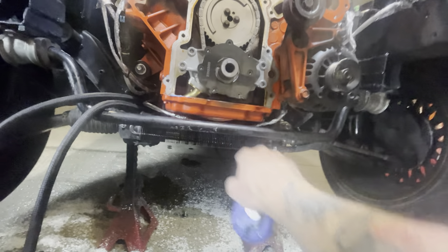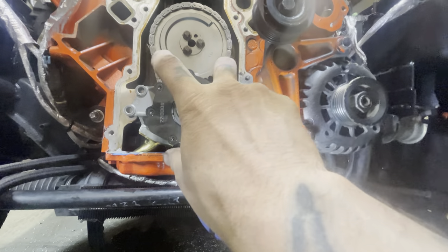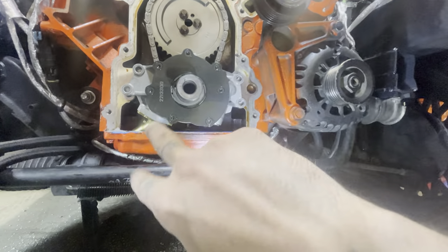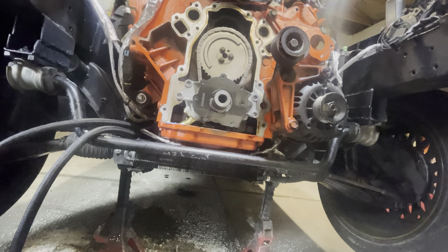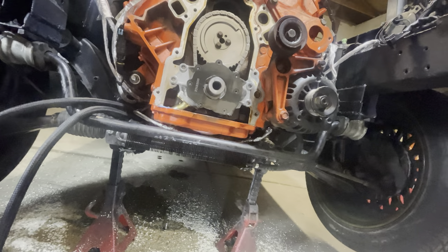So that means I've got to drop all this stuff out of the way — maybe even the whole crossmember — drop the pan, just to get this one bolt out. Then I can pull this off, put the right o-ring on there, and figure out why it's moving. Oh my god. Thanks for watching, like if you like, subscribe — this is frustrating.